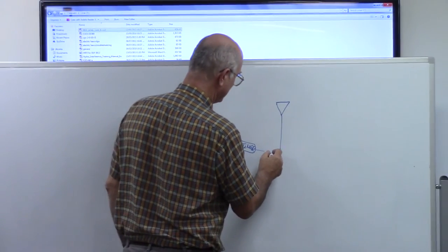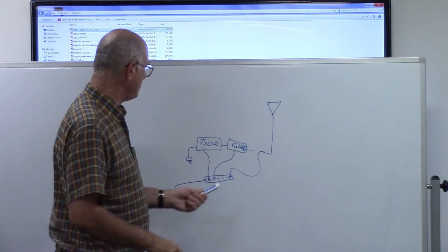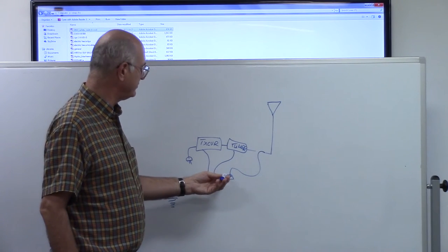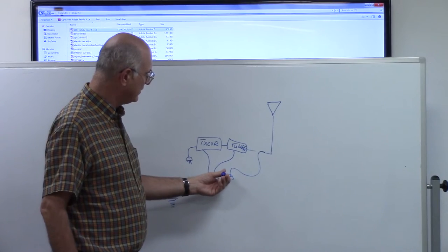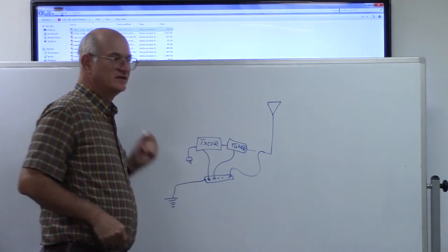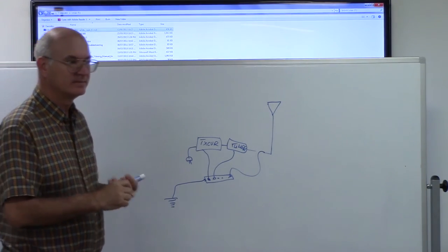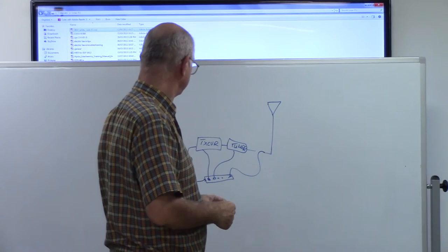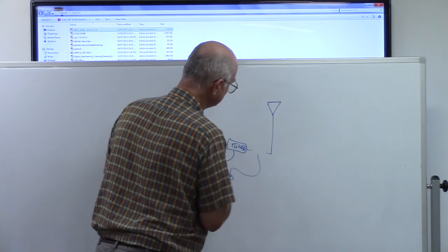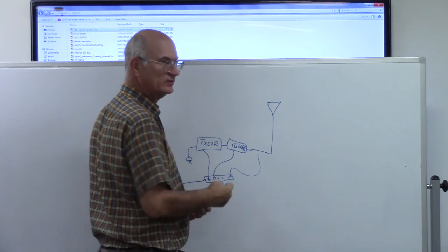disconnect your cable and put it right under your ground. What some people do is they put a SO239, just the socket style, and mount that right to the ground bar. So when they screw their coax on, it's grounded, both the shield and the center. And that's a perfect ground. But if you forget, this might save you too.